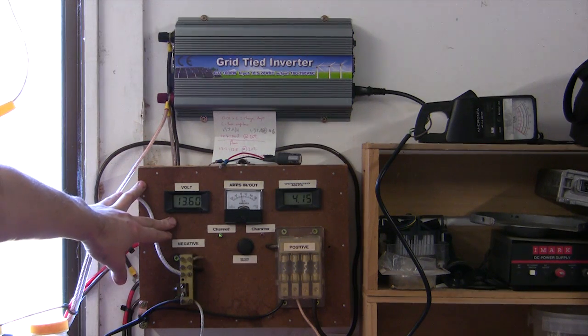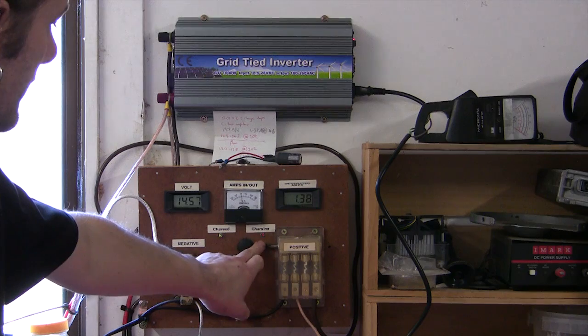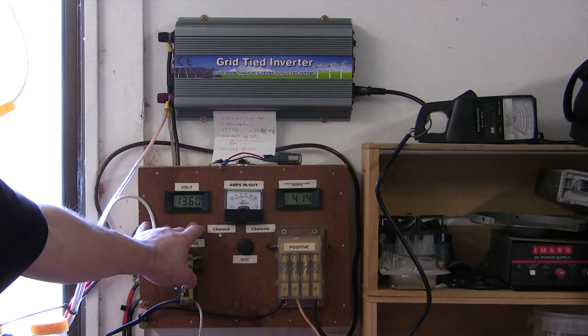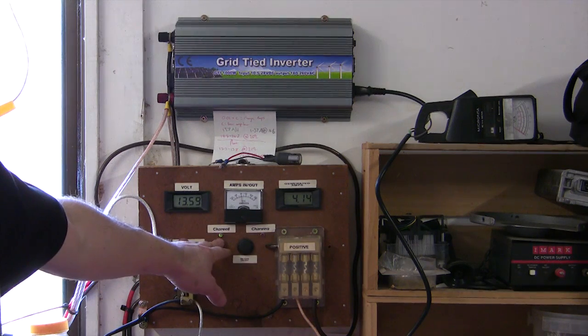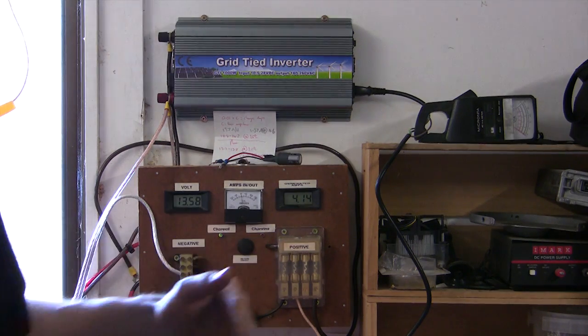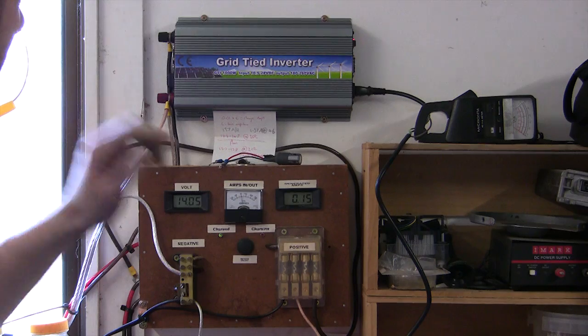As you can see, the two LEDs are clicking from charging to charged. My voltage is at 13.6, and when it reaches 13.55 it clicks over. I've got a negative bus bar and a positive — there we go, just clicked over to charging. You'll notice the voltage gets up to about 14.4, which is what I've set it to. Once it hits 14.4, it clicks over to charged and disconnects the solar panels. So basically it's a pulse charger — it lets the cells creep up and then cuts them off when they hit the set voltage.